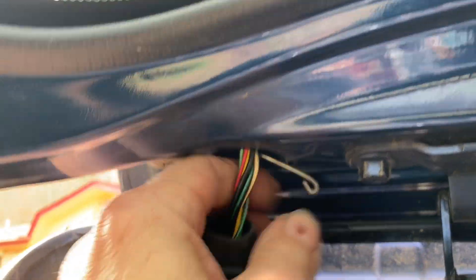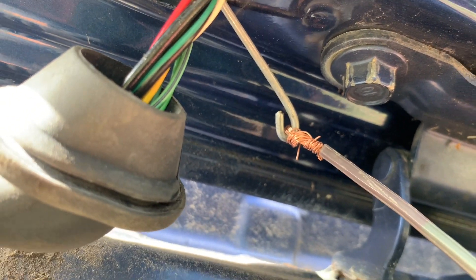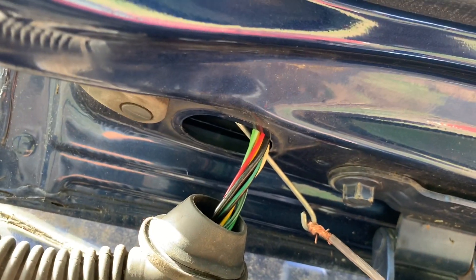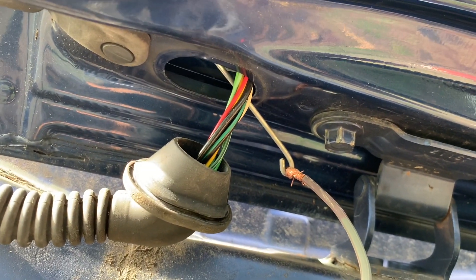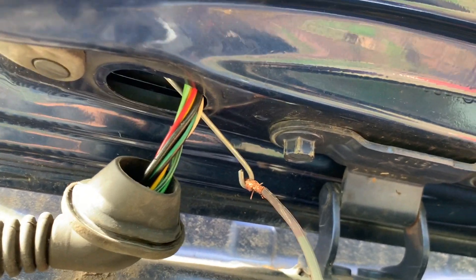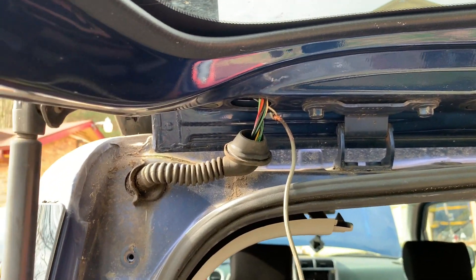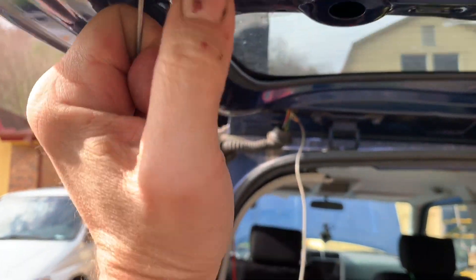There's our snake. Here's how I'm tying on the wire to the snake — put a little loop in it, hook it onto the loop of the snake, and we're going to pull it back through that hole very easily. We don't want to snag any of our old wiring and rip that out or we'll create a bigger problem, so we're going to gently and persistently run this wire back through the door. Pulling on the coat hanger here.